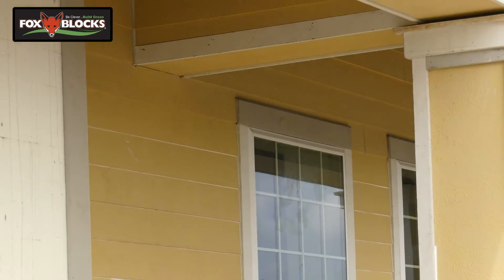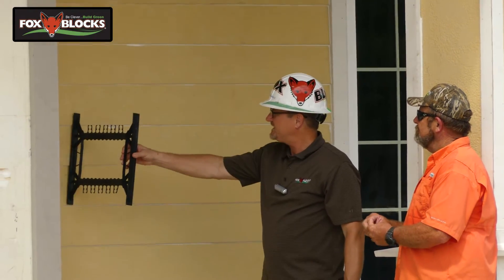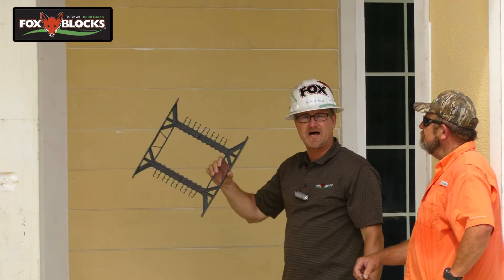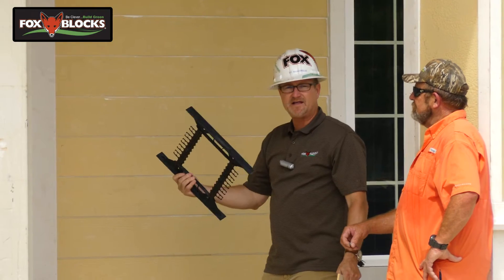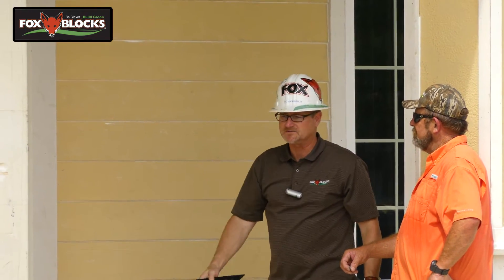All these 48 by 80 inch windows are well fastened and meeting code. Every eight inches on center we've got our web ties along with the furring attachment points that are an inch and a half wide, providing exceptional pull-out strength.